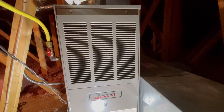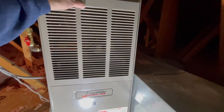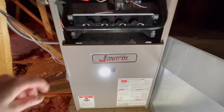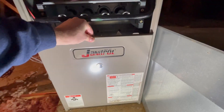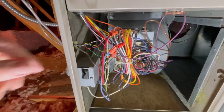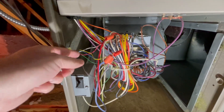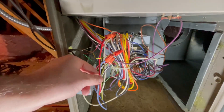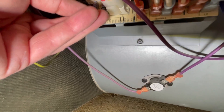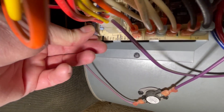Here we are at the access panels to the furnace. I'm going to first remove the top panel — it just pops off. Then I'm going to remove the bottom panel where all the wiring is — slides up and out. The wires right here are the ones going to the thermostat. You can see the red, which is the RH — that's not working currently, not getting power to the thermostat. What I'm looking for is a fuse down here on the bottom. I'm going to pop this off — just a little 3-amp fuse. Take a look at it. Still looks good, so that wasn't it. That would have been simple if it was. Put that back on gently.